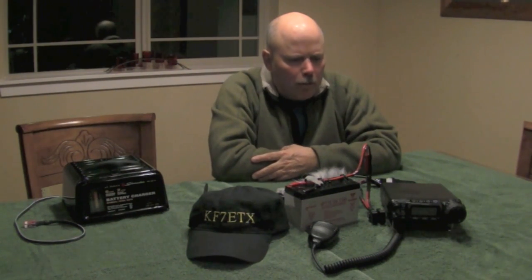All right guys, there you have it. We just did a radio check with this 857D powered by a 12 volt 7 amp hour sealed lead acid battery. Worked great and we got a good QSO with a local ham. How lucky is he to have won one of those at a local hamfest? Great way to meet fellow hams, socialize, and you never know — you might win something. I'm pretty pleased with this setup. The next step is to get this packaged up so I can mount it in a backpack. I'm looking forward to doing some SOTA activations — summits on the air — there are some local peaks around here.